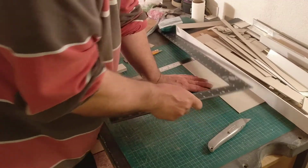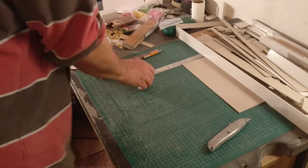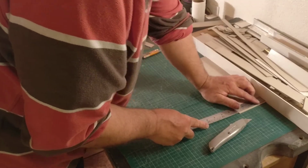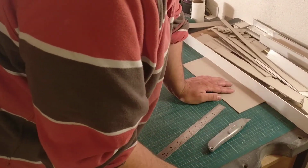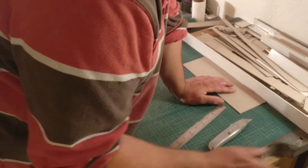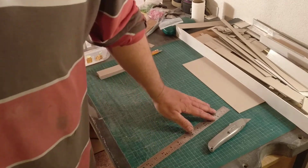You see, it's worth doing that because I measured 3.5 there, and I measured 3.5 there. I might have measured it ever so slightly out, or I might have made a cut just ever so slightly wobbly, and that's why I lost my square. Anyway,